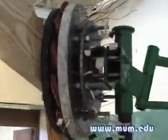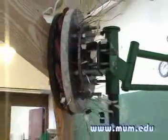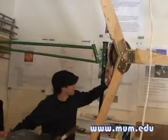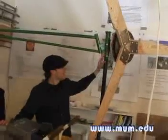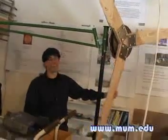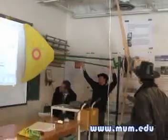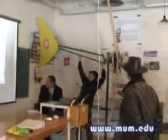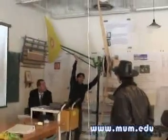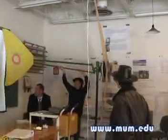This is basically a kind of open-source design that's been developed over the last maybe ten years or so. This is the generator component right here — it has magnets here and coils underneath, so the magnets spin with the blades and produce electricity. When the wind gets strong enough, the tail tilts up like this, and it will go up enough that it will be basically parallel, so the blades will tilt out of the wind when the wind gets high enough.